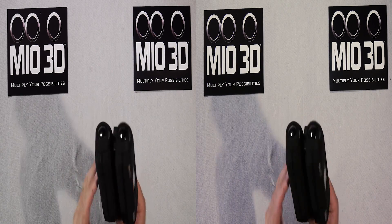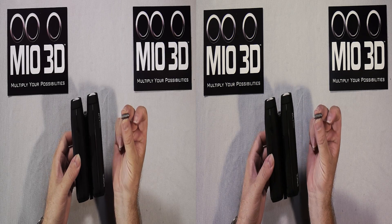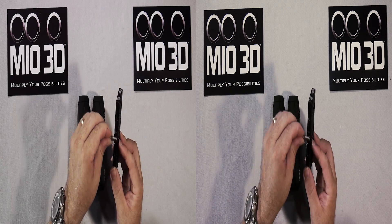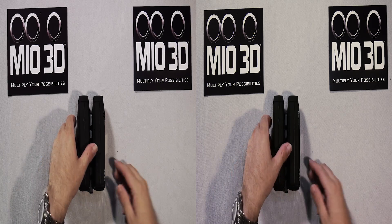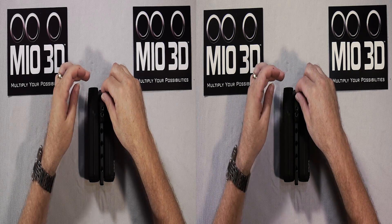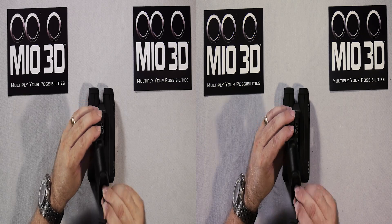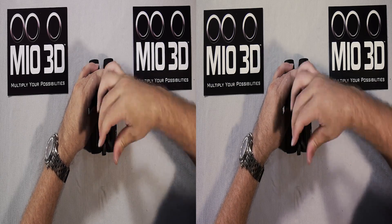For another quick setup, this is a two-camera 3D rig with a multi-plate one by three. We'll take a little set screw inside the multi-plate and attach to both quarter 20s. Instead of putting it in the middle, we're going to put it right through the 3/8 hole — you can also thread it through any of the threaded holes, any position forward or backward. I'm going to purposely offset it into the 3/8 hole to allow a little more play and move the multi-plate past the edge to get the grip block into place. Then attach the grip block and attach the grip to the grip block using a quarter 20 with a little Allen driver — tighten that down.